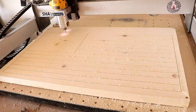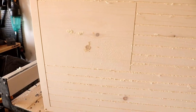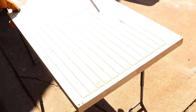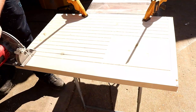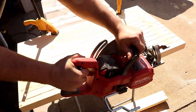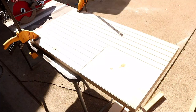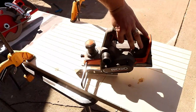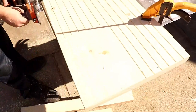A helpful tip: when you're looking for wood, make sure you go with something that doesn't have crazy horrible knots. You can see right here I patched up a piece — I'll show you how to do that in a bit. Check it out: you've got all your stripes, your union, your flag basics. Now let's cut off those extra ends with a circular saw. If you don't have a CNC, just measure them out, set up a straight edge or long ruler as a guide, and cut about an eighth of an inch deep — that's all you have to do.